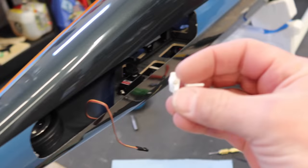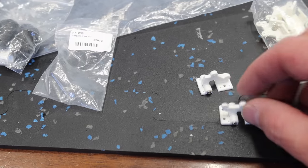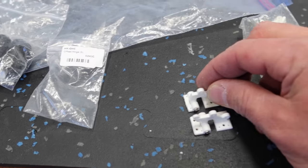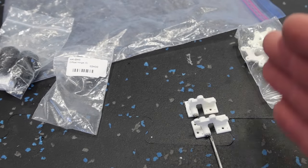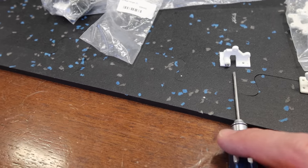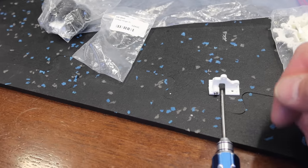So I was also playing around with the hinges a little bit. So we'll use our standard offset hinges. Now this is the way they come, like that. So we have clipped the back piece off, that piece off, you can see there, and then also our back mount here, the fuselage side mount, trimmed that back a little bit so we could tuck it over. So what happens here is if we leave this piece too long and the fuselage joint is right here, it kind of pushes the hinge out too far, so the hinge won't work properly. So when you set these things up, if this is the fuselage door joint, you need it pretty much centered like that, and that's the way they work best. So anyways, that's how we have things set up.